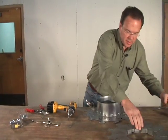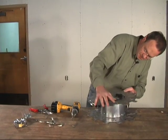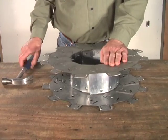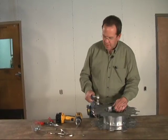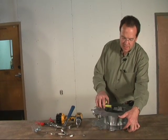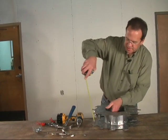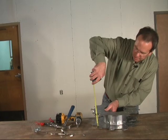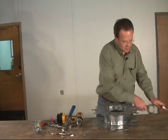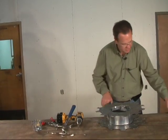Now we need to take the top part of the compression ring and slide it inside here. You need to always be sure to make your compression ring a quarter inch taller than your ribs, because you're going to be nesting two of them together and they're a little taller than just three and five-eighths. So instead of three and five-eighths, we'll make it four inches — that'll allow for the extra height. Now I'm going to flip this over and screw this top ring in place. I'm going to clamp it down so I can really put some screws in it.